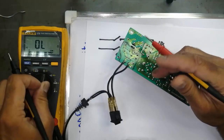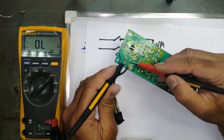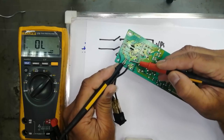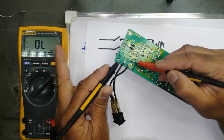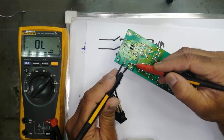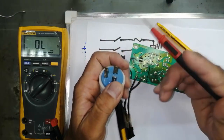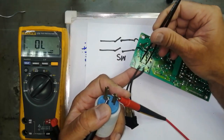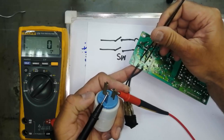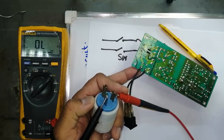One line is here after the fuse, and the voltage arrestor is in parallel. You can check it with your meter using continuity — it should be open. If it is giving continuity, remove this component. If you find continuity here at the input terminal, and this component is shorted, you will find continuity there.